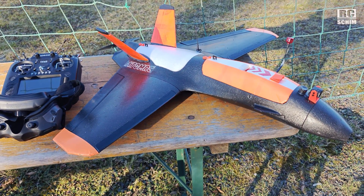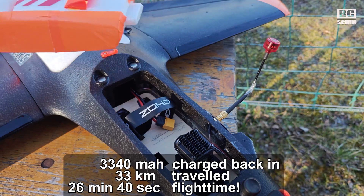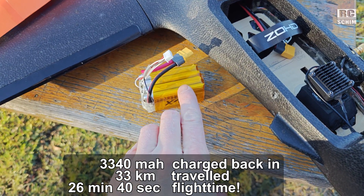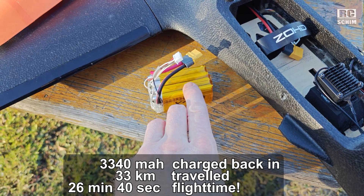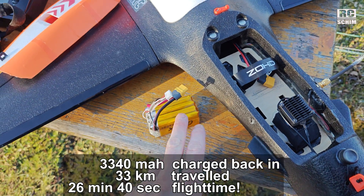I just had a really relaxing flight with the Dolphin. The Dolphin hasn't changed a lot since my last tips video, but I got a good 3000mAh out of this 3850mAh pack. It was a really good flight — I landed at 3.2 volts, so I still had a good amount of juice left. It's a nice option and they work quite well. If you have similar cells, let me know in the comments — I'm curious to learn what you're using. Of course the other quite easy way to get good long flight times are lithium-ion packs, but lithium-ion has a bit of a lower voltage and so a bit less power than these here. Thanks a lot for watching, see you next time, bye for now.